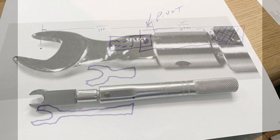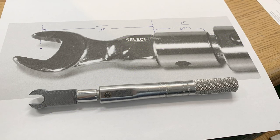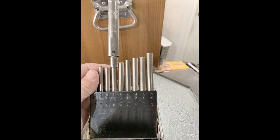Here's a picture of what I'm missing — it has this little open-end wrench that goes onto the handle. I kind of reverse engineered the size of everything and created a file and 3D printed a wrench just to check out sizes, since it needs to be steel. I measured the diameter of the hole it goes into — it's around 7.92 millimeters.